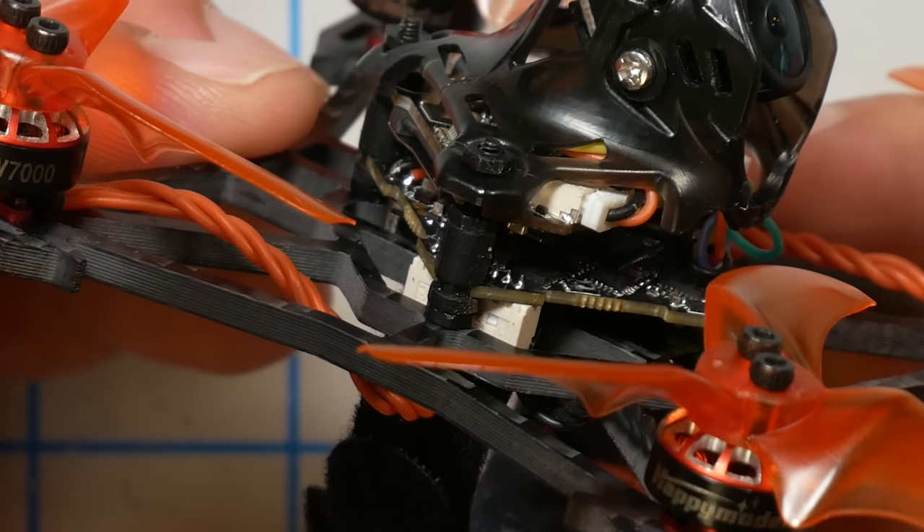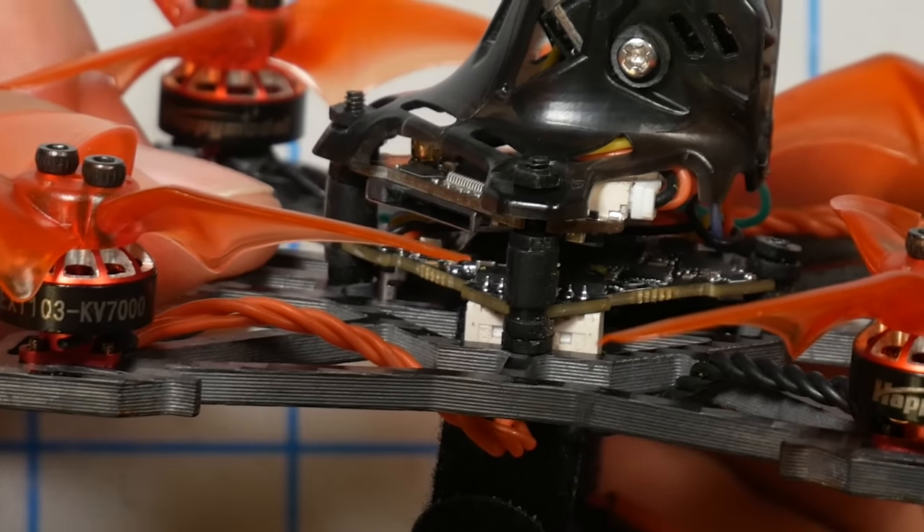The flight controller is the Crazy Bee F4 Pro. The version I've got is the version with the onboard FrSky receiver. It can do FrSky D8 and D16 mode simply by changing a setting in the Betaflight configurator. In the past, the Crazy Bee flight controllers have had an issue where they would lock up for no reason if you're doing D16 mode with telemetry. Betaflight says they've released a fix for that, so you should be able to run D16 mode with telemetry on this with the latest versions of Betaflight. If not, it's an easy fix — you either just turn off telemetry or you switch to D8 mode. Some micro pilots prefer to fly in D8 mode anyway. You can do either.